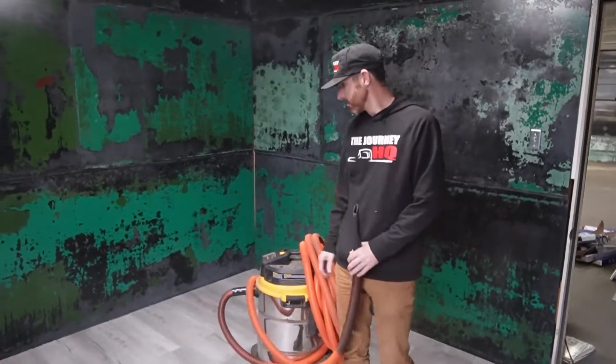Dude it's clean. What do you think of your floors? Your floors look amazing. We've finished this office flooring and what I learned is just do it right — just get down there and do it. Don't worry about all the precise measurements; your baseboards are going to cover up all your edges. You need a gap around the sides for expansion and contraction. It's only going to go in one spot — it's pretty easy. If it's not straight it's not going to go together. Once you find out how to put it together, just go after it. You can do it. Appreciate y'all watching — do what makes you happy.